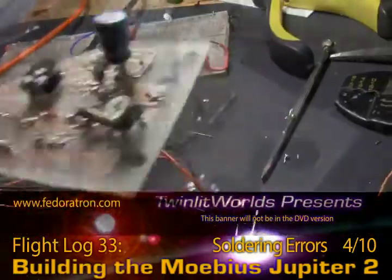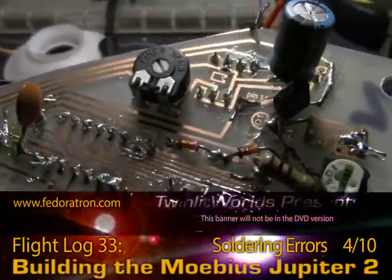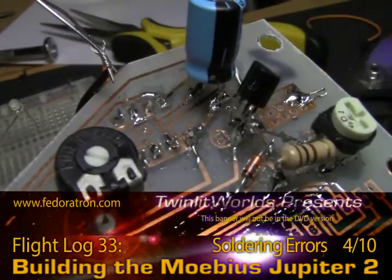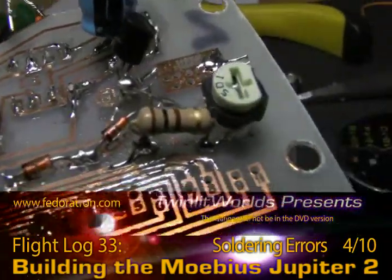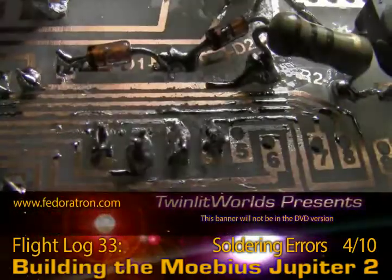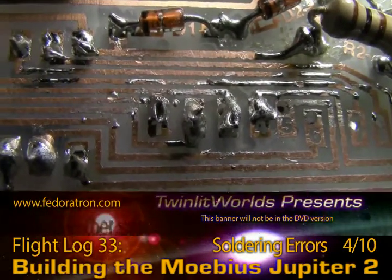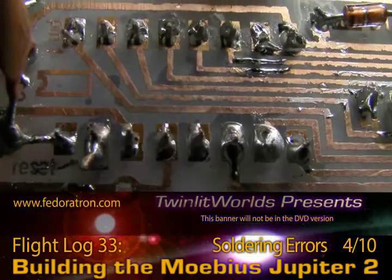Let's take a look at the board itself. That trace leading to the capacitor alone is a really good example of how bad everything started falling apart on this one. It was largely my own fault for leaving the solder on too long because it just wasn't heating properly, but everything else was still getting hot. This fat resistor here — those legs simply would not heat up or solder at all. All the solder along these lines is either accidents I had to spread out, or weak trace points, which were likely largely my fault.